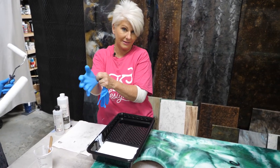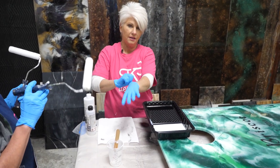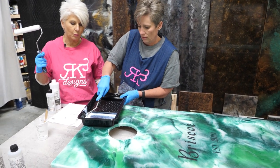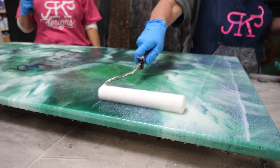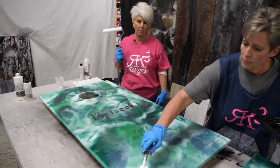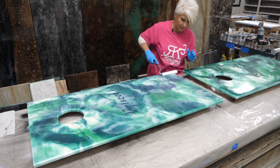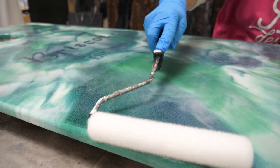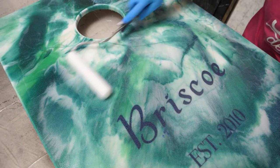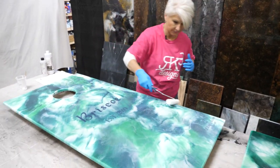It's really great practice if you can get someone to help you, because you'll lay out a much smoother finish with two people. When you lay out your material, make sure you really saturate your wet roller first. Then start at one end and be consistent with the amount of product you lay down. Don't go back over one area too many times. Then come back with your dry roller and start feathering it out — I'm literally barely holding my roller, putting zero pressure on it. I'm letting the weight of the roller do the work.